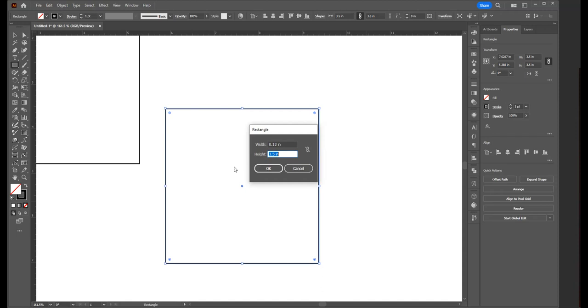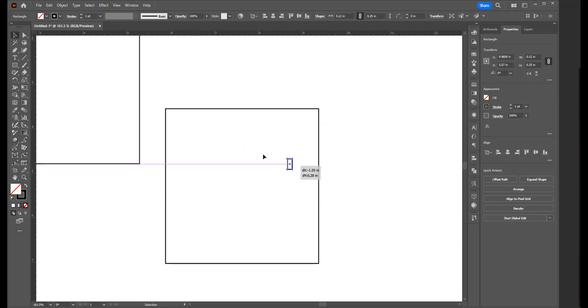Anyway, but you don't always have to. And I'll show you probably in another session how to do tabs that sit down into the base versus having just a loose box. And then the ones that sit in the base actually don't need tabs on the sides at all, which is kind of nice. Then you can have a design that doesn't need to have anything intruding. But for today, we're going to do a 0.12 tab. That's the thickness of my material. And the height, I'm going to go with probably a 0.25 height. So it's not much more than what you need to just work the material together. It gives you that little bit.